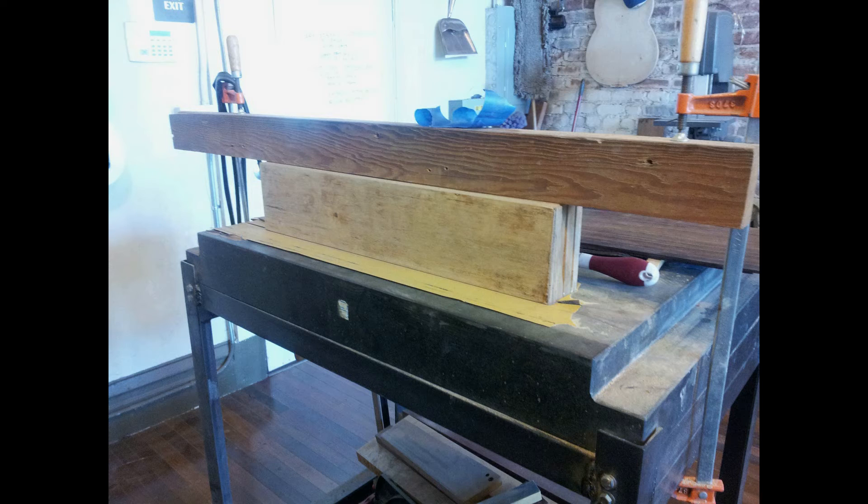This is a very large, very heavy, very flat piece of granite. The side of this is set up to be 90 degrees to that. So we just lean our pieces up against the side of it, sand a little bit, put the pieces together, walk up to the window, look for light cracks, and just keep going at it until the silly things mate.